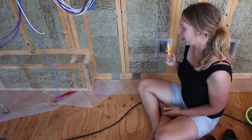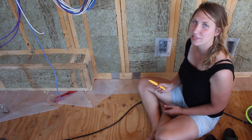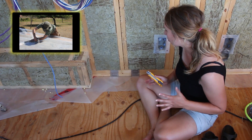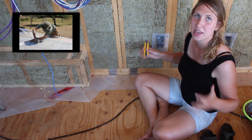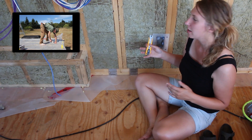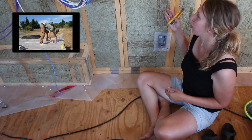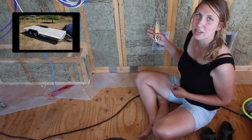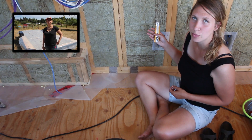We're coming up just shy of a year since we actually installed this. The whole goal was to create a vapor-tight plastic bag on the inside, the warm side of the insulation. This will prevent condensation from forming on the inside of the wall cavities.